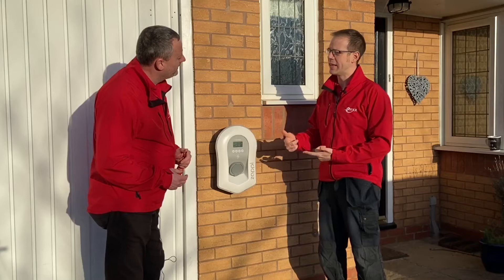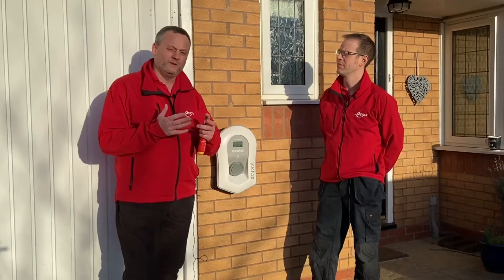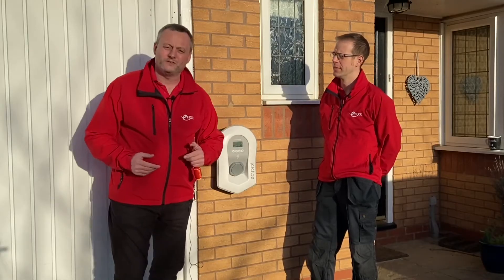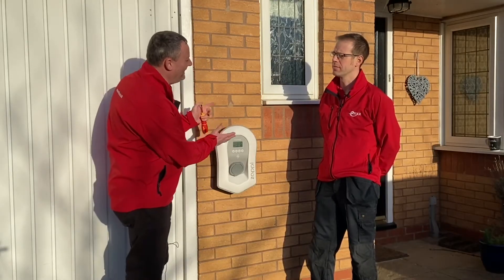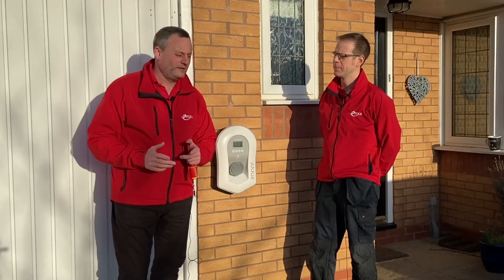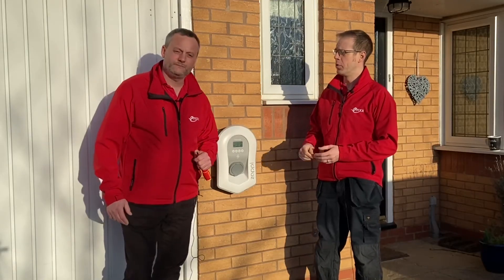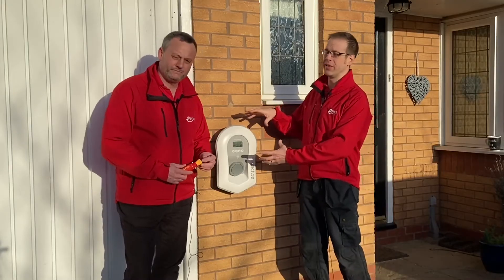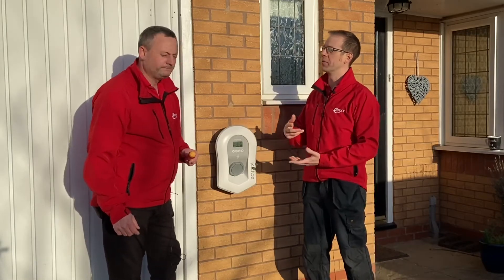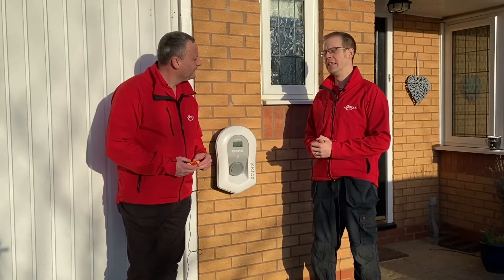In this video, what are we particularly going to be thinking about as we move into a more advanced installation? We've seen in the past people fitting outside lights and socket outlets with an IP rating. Now we're talking about highly expensive electronic equipment being screwed to the exterior of a building, and ingress of moisture becomes even more crucial. With the changes to Amendment 1 we can expect more complicated bits of kit inside our EV charging units, monitoring currents, voltages, and all sorts of things - those items are increasingly sensitive to moisture.